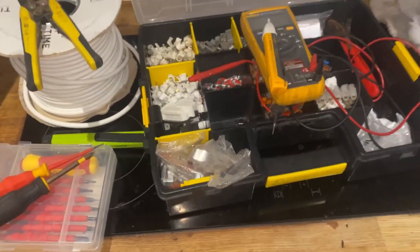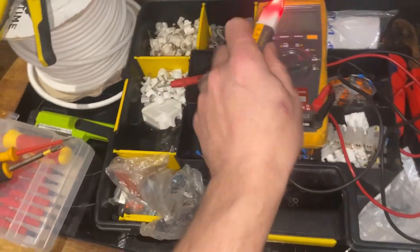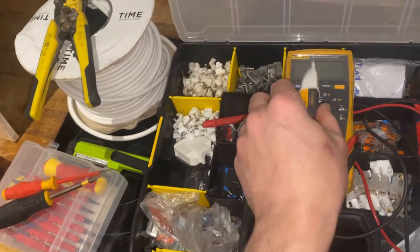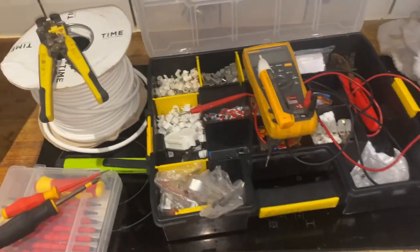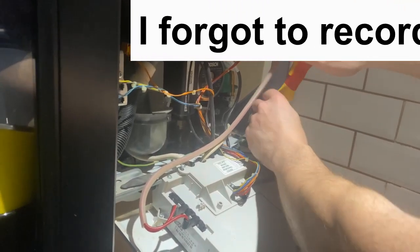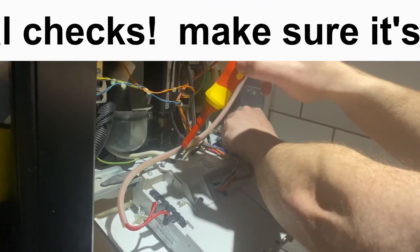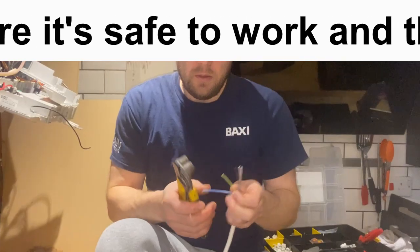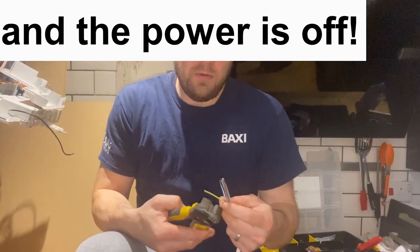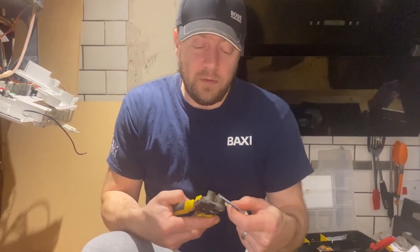What we're going to do is wire up the stack. First we'll do our safety checks and talk you through it. I'm just going to take the cover off where the cables and PCB are stored. We're going to cut off a length of cable and strip the wires down — you want to take about five millimetres off the end of each.